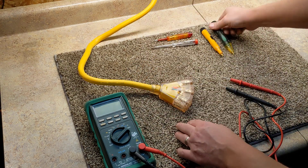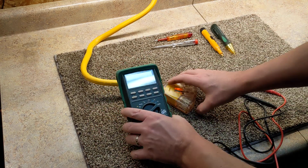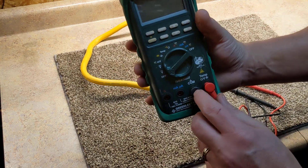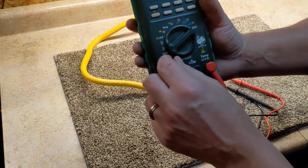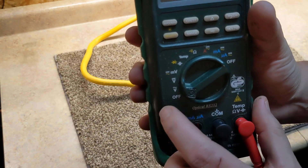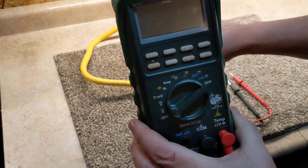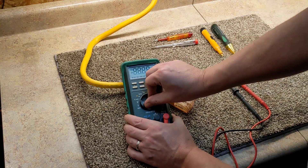The ultimate is obviously a meter to get a definitive answer and a reading. Even just to ensure something is live or dead for voltage, common is common on black, and you want to make sure you're in the V for voltage setting. On your voltage settings you can see there's straight-and-dotted lines and a curved line — your sine wave. The dotted is volts DC, the sine wave is volts AC. Anything in your home is AC — alternating current. DC is from a battery source.